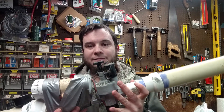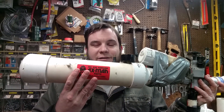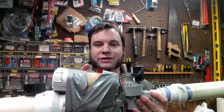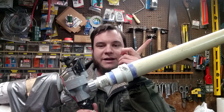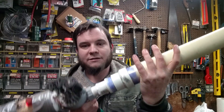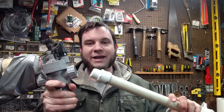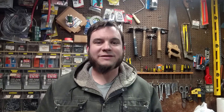The other major style is pneumatic or compressed air. This one is pretty rough but it's got a basic chamber holding the compressed air, a fill valve, a gauge, an ignition system, and that ignition system activates this electronic valve sending the air into the barrel and shooting out the potato. One thing that's nice about this design is that the barrel is removable, so you can put different sizes on here to shoot things like paint balls, or in my case I use this smaller barrel to shoot cherry tomatoes. It turns out that a cherry tomato can do quite a bit of damage to a car door, so don't try that at home.